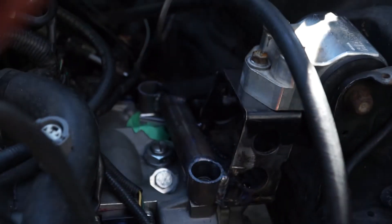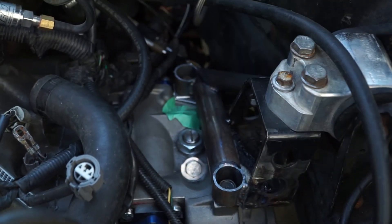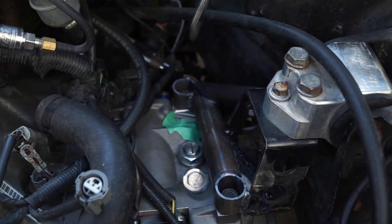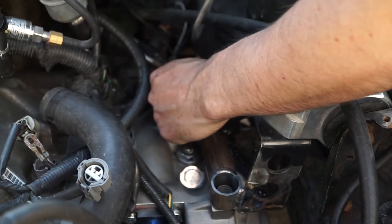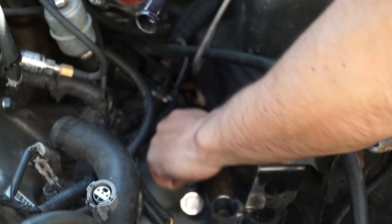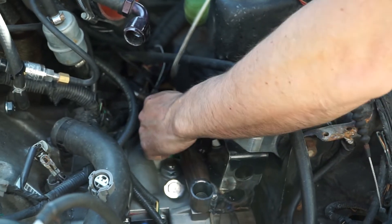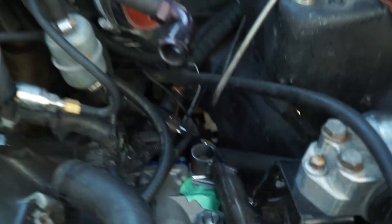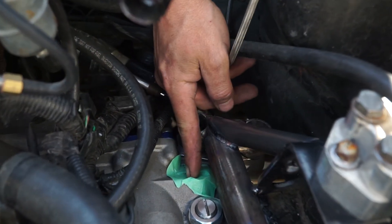Got the mount on, welded it, looks good. Added a little reinforcement brace, so I'm pretty happy with how it turned out. Although I just looked — I might have to modify it because the reverse release comes in there. I'm probably going to have to angle-cut or grind it so it clears. It looks like it's going to hit, but I won't know until I try it.